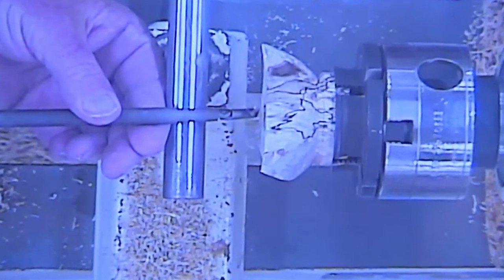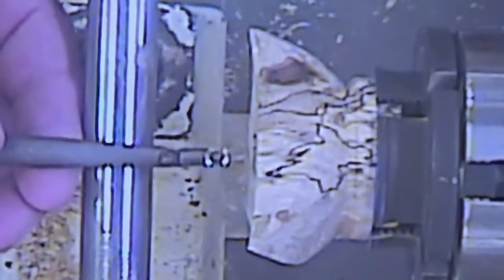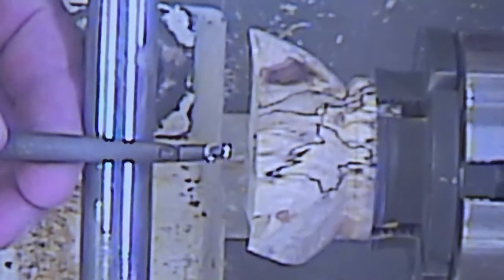It will still cut, but not much. As I start cutting, I will roll the handle clockwise to about 8, 1/4 after, somewhere. You'll feel it, you'll hear it where you find that sweet spot. But if I went in here at 90 degrees, oh, it would cut, but it would grab.